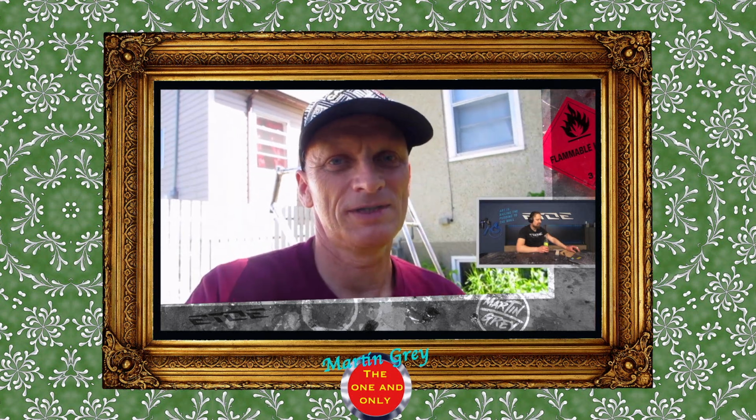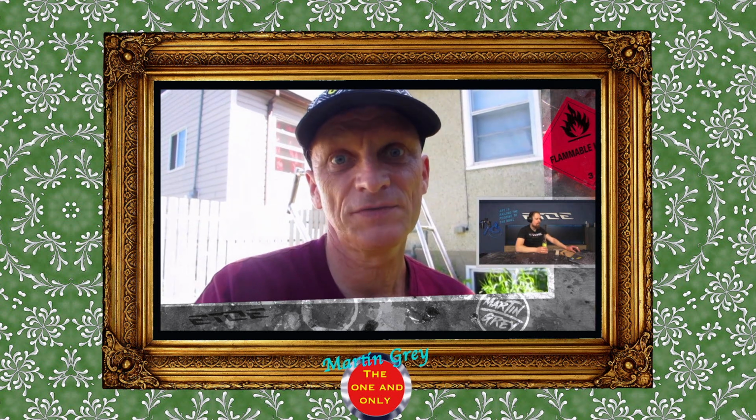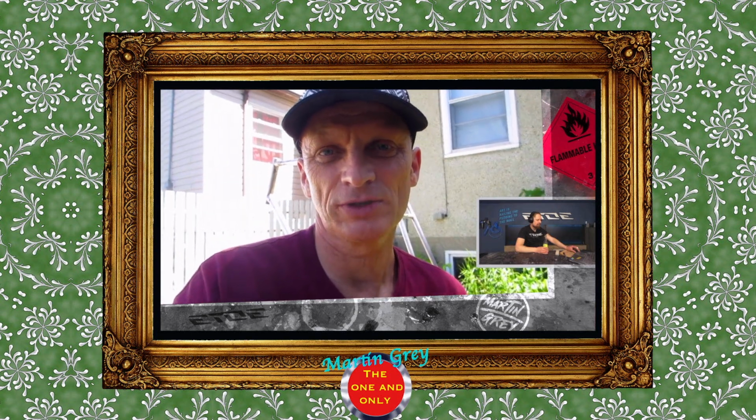Yes, that's right. What he's doing is right. Use alcohol to clean the frame. Never use water. It will rust immediately if you have a steel frame. George does it right. Once that is done, I would leave the frame alone for at least a full day and then sand it with 1500 grit sandpaper, very lightly.